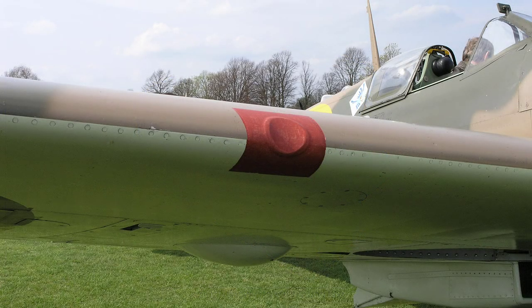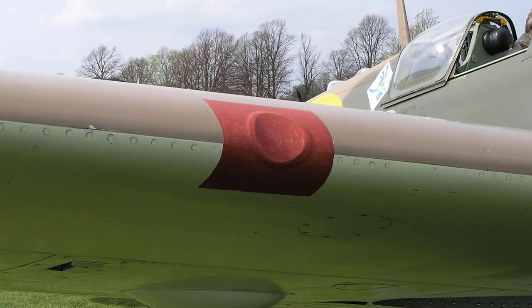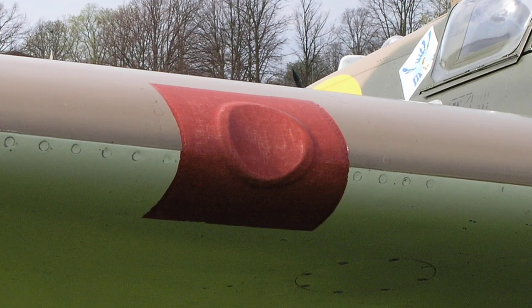When the guns are not fitted, the forward ends of the blast tubes must be covered with a double thickness of fabric, doped over the leading edge of the plane. The aeroplane must not be flown without either the guns or this covering.